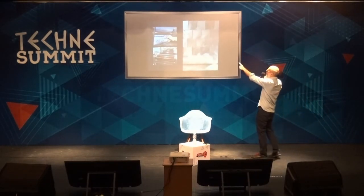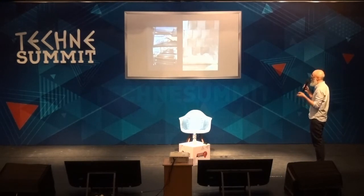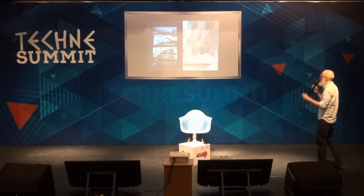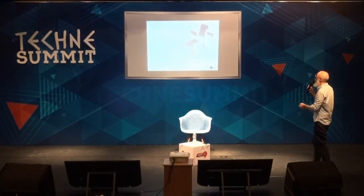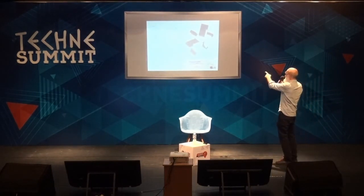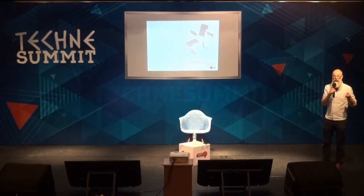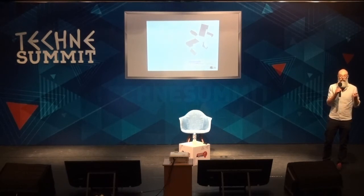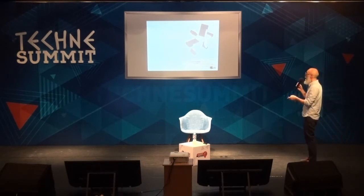The aluminum cover is a local material — we take it from offset printing companies in our street in the workshop. We take what they call the slab, the place where ink is transferred to paper. It's made of very good aluminum that they throw away once printing is finished. We recycle it and fold it to create a scale system, a bit like fish scales, protecting the building from rain. The joint is created by a code in Grasshopper which directly creates the electronic shop drawing from which the joint is laser cut. The beams are cut by the robot directly to the right size, and there's only one way to assemble this — creating itself automatically because it's only triangles.